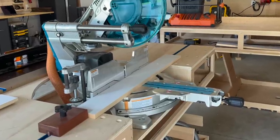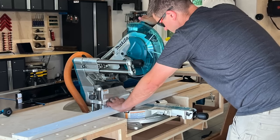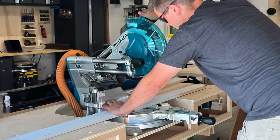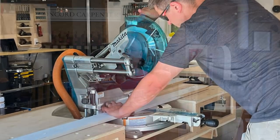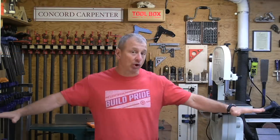Some important dimensions when designing a drop-in miter saw station are the footprint of the saw, the height of the saw base, and the arc of the swing when moving the angle. You want your saw to fit in as snug as possible while still allowing a little bit of free movement. The base of the saw should sit at or just barely above the station top workspace so that you can support work on both sides.